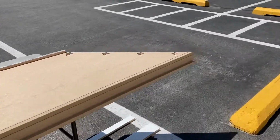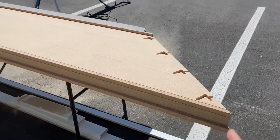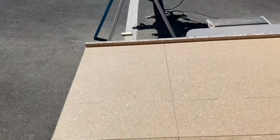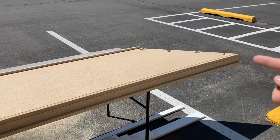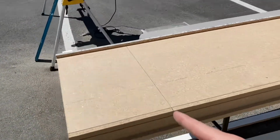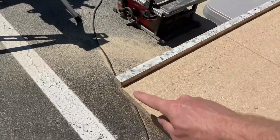When you're measuring to cut a corner countertop, you're gonna measure from the long point all the way down to where your next cabinet is, or your next wall is. In this case, it's 104 inches and 7/8. You can't really measure from that side up there because it's not square. So you measure this side first, your full length, and you make your mark, and then you can measure over from this side to here, and then to make that mark over there, from this side to here, because then that gives you a nice square line.